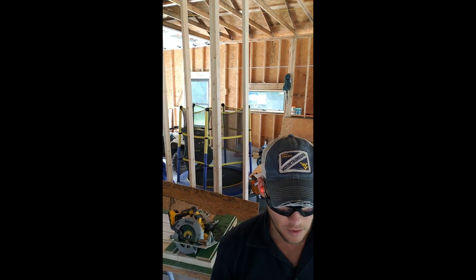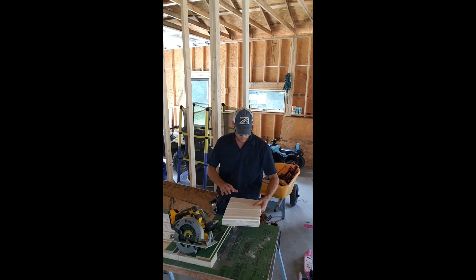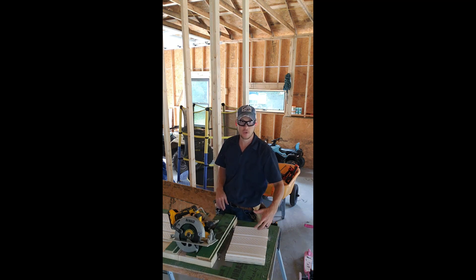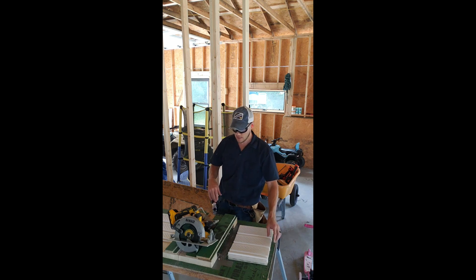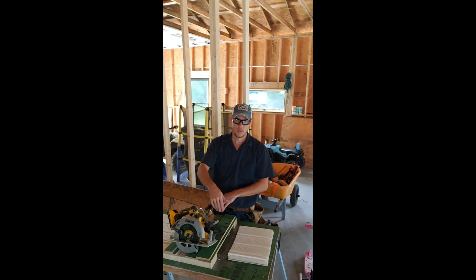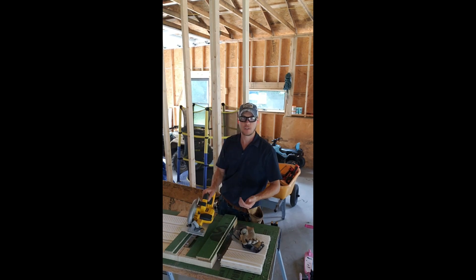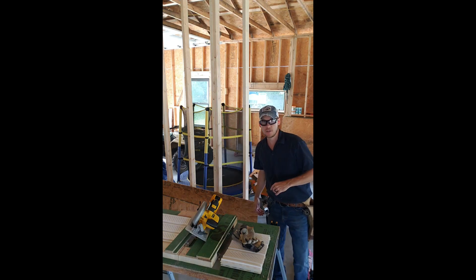I hope you guys enjoyed that video and learned something. If you're using a miter box where nothing is supporting the soffit to keep it rigid, turn your saw blade backwards. If you're using a regular hand saw without a jig — maybe a framing square and something like that — turn your saw blade backwards. But when you're using a soffit jig and pulling that saw in reverse, the downward stroke is catching the soffit and pushing it into the table, making it more rigid so you get nice clean cuts. When you push forward, you get an upward bite with nothing supporting it, causing the material to break and chip. If you got some value out of this video, hit subscribe and hit that like button. Appreciate y'all — have a blessed day.